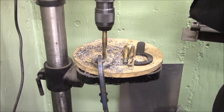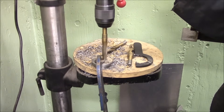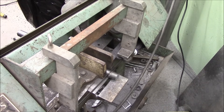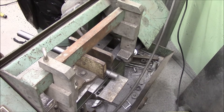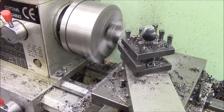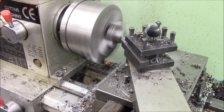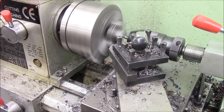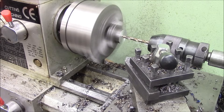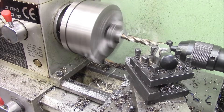Again with the big drill bits — these drill bits are not happy with metal, let's be honest. This will be one of the sleeves for the eccentric bar that goes through the whole width of the bottom. I'm using carbide cutters. I used to have a fancy quick change turret on the lathes at school, and I would use carbide cutters, but the kids wouldn't notice that they shattered the carbide cutter and then were trying to machine their projects with the cutter holder with no cutter on it at all.